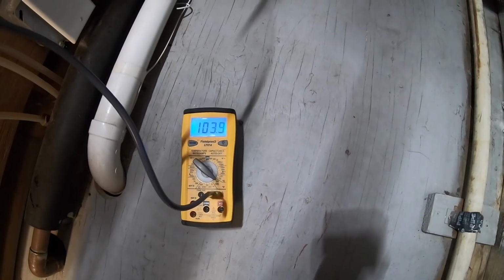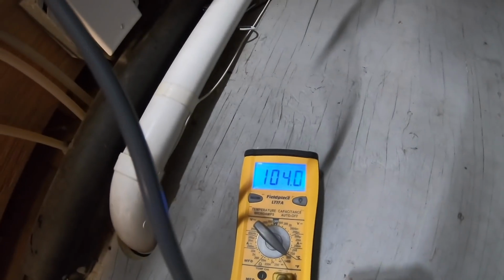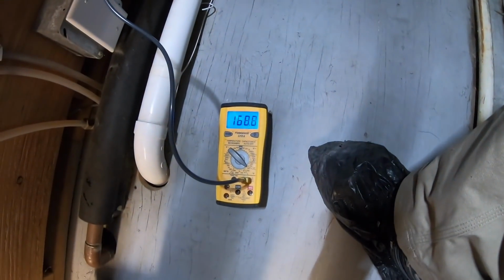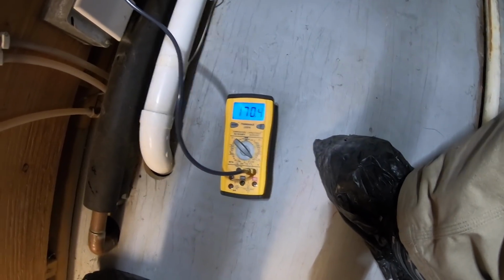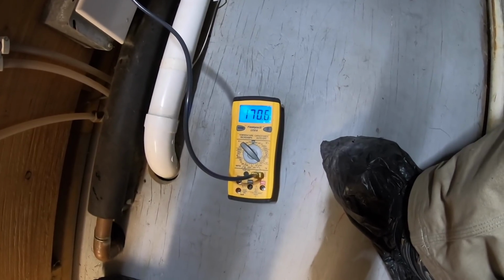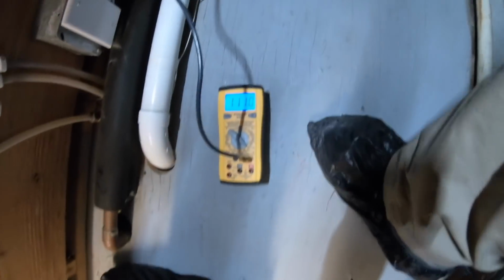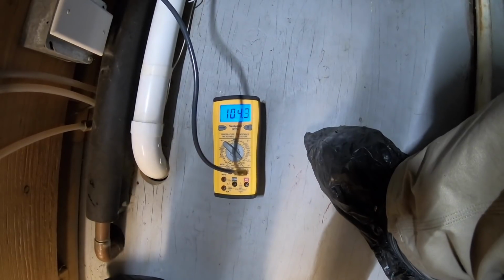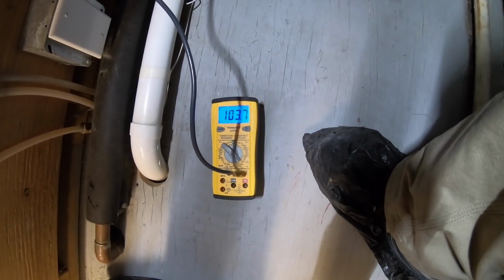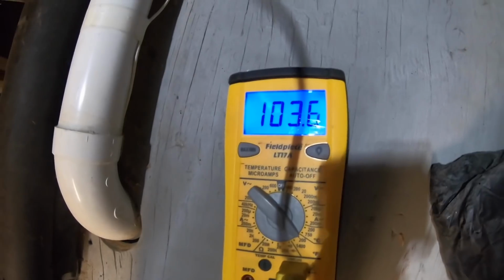It's good heat transfer into that floor. It's gonna set a little lower, but my biggest concern was it's over the garage. So therefore I didn't want to do that. Now, my supply up is about 170. So here's my supply temp coming up. And my return on the other side. Like I just tested, 103.7. So that's the return temp right there.